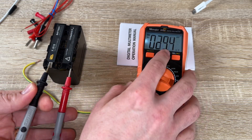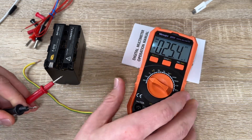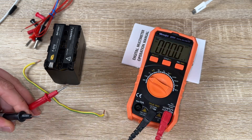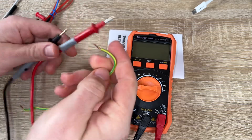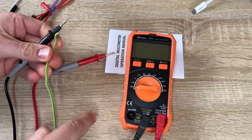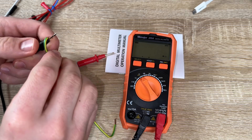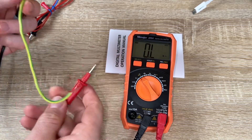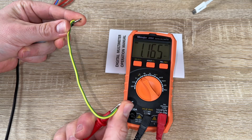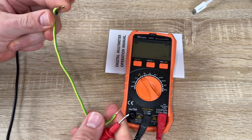The DC current is 600 microampere with ±1.2% accuracy. The AC current ranges are 600 microampere, 6000 microampere, 60 milliampere, 600 milliampere, and 10 ampere with ±1% accuracy.